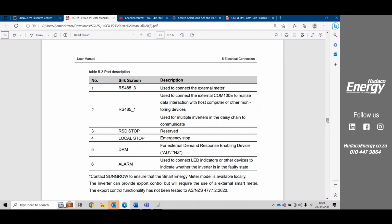So they've made them a bit smaller now, or rather more compact. There are a few things that I probably would have liked unchanged, like for instance the IM4, which is quite a handy little dongle. That handy little dongle can take up to 10 inverters, so you can easily do a 1.25 megawatt plant just based on that one little dongle.